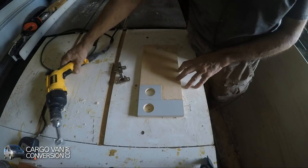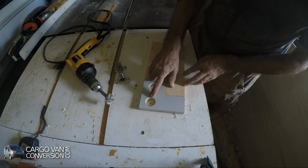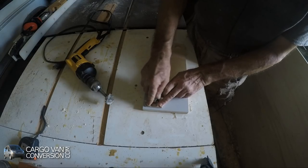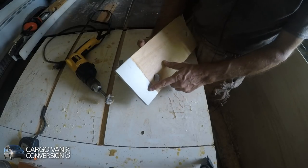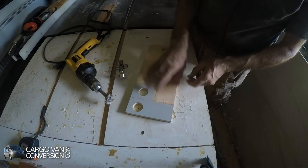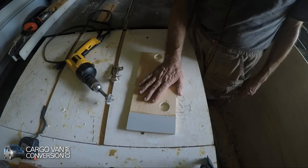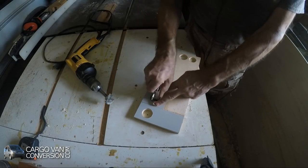After drilling two test holes with this Forstner bit, I found out what I thought would happen on the double-sided Formica door if I started drilling a hole. This hole should even be a little bit deeper because it's still wiggling. But you can see that the point of the Forstner bit comes through the other side of the Formica — so that doesn't work. What I have to do is put the Formica on one side first, drill the hole, and then put a laminate on the other face which will cover the hole. Then I would still have a working door.